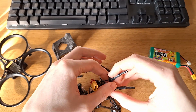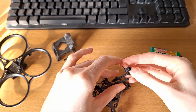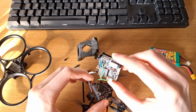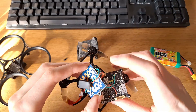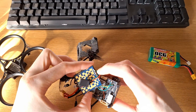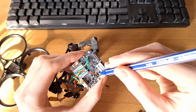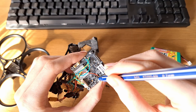I have this 3D printed part here for mounting the antennas. You can find all the 3D printed parts in the description — I've made them available on Printables. The 5V power from the BEC goes to the wifi module, and ground is also connected to the camera, so the 5V power comes into the camera here. I found this is the place where you can connect power — it's soldered to one of the terminals of a diode.